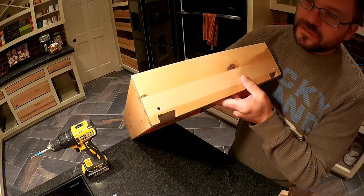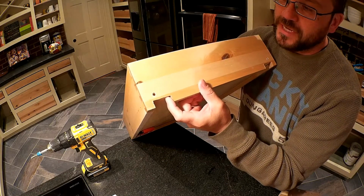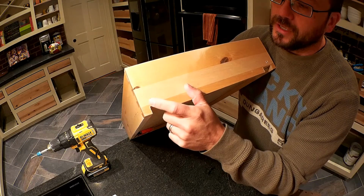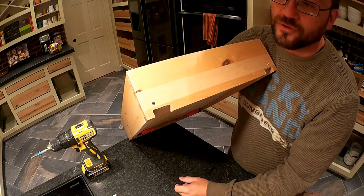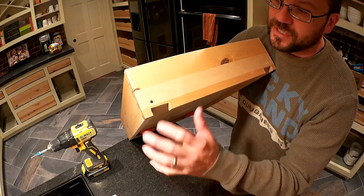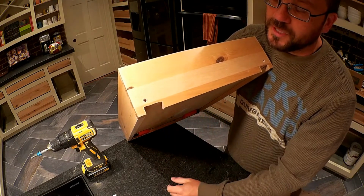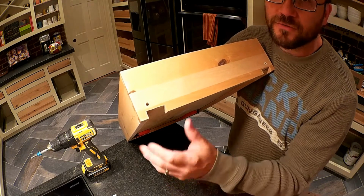When we originally got the drawers, most of them did have notches, except for the ones that I had to have replacements done, but they did not have the boring completed, so we had to actually bore this hole. They weren't going to replace all the drawers that didn't have that accomplished, so I just decided that it was easier for us to bore it. But since we had about 30 or so odd drawers that we needed to accomplish, it was best to go ahead and create some sort of a jig.